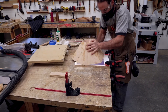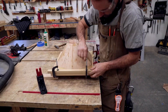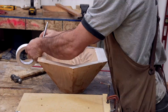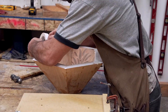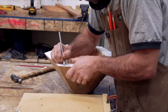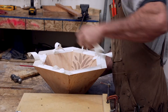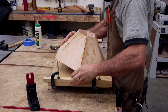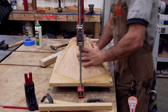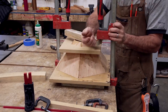One thing I was worried about was having the bottom perfectly level, so I leveled it up a tiny bit with some sandpaper. For most of my bowls, I machine the bottom and outside of the bowl first, upside down. I used alignment jigs to get a general position on another scrap piece of MDF, then put double-sided tape along the top lip. I tried to use as much tape as I could because there wasn't going to be a lot of surface area to hold it down, and I was worried it might pop off. I put the double-sided tape down, scraped it really hard, put my workpiece on the table, and clamped it on tight to ensure really good adhesion.